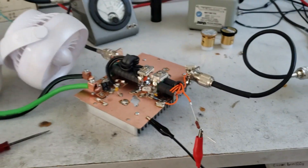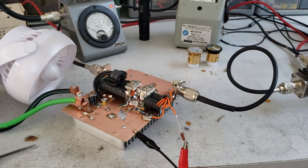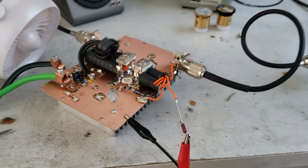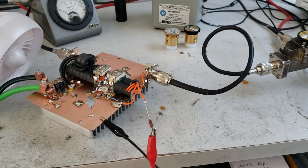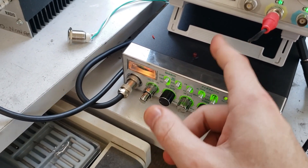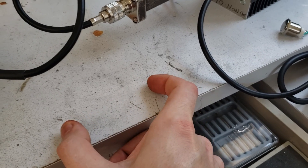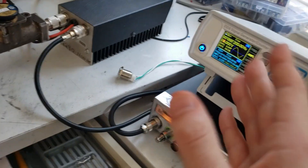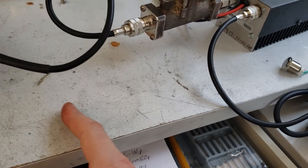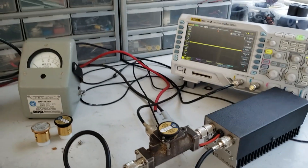I just thought of something I want to add to this video. In every amplifier topic, thread, or video, there's always that one dude that's like, 'Oh, you're building splatter boxes? That's a cool splatter box, bro — you're going to go mess with everybody's television.' There's a lot wrong with that, so let me clear it up. Splatter is one thing — splatter comes from your radio, and it can come from a bad pairing of a radio and amplifier. Splatter is when you're transmitting outside of your bandwidth. Most frequencies you have 3 kHz audio bandwidth as your limit — splatter is when you go beyond that and start splattering on adjacent channels. That's all splatter is. Splatter isn't TV interference, it isn't out-of-band transmissions, it isn't harmonics.